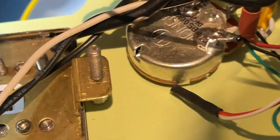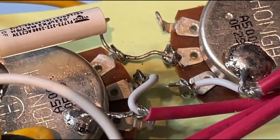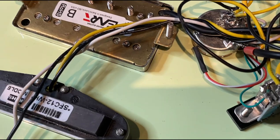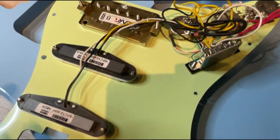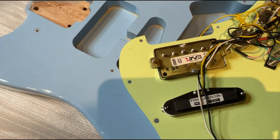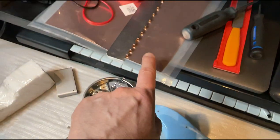If you were going to take this guitar out to a gig, I think you'd find a lot of noise as soon as you stepped under the lights. So you're definitely going to want to insulate this. And to change out the electronics, you're going to run into a bit of a snag, because unfortunately this pickguard is not a direct drop-in in terms of the way the holes and things line up. We're going to take a closer look at that in a minute. But first, I'm going to go ahead and put some copper shielding in here to bring the noise down.